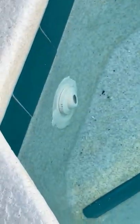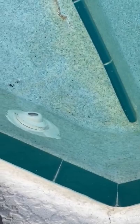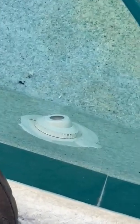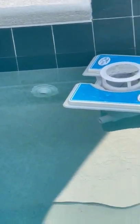Return lines are good as well. There are four jets here — the return line pipe is good, but around the jets it's all patched; it was already patched with epoxy around all four jets. Even with the patch, it is still leaking around the pipes, between the pipe and the diamond brite. All four jets are still leaking, even though there's already a lot of epoxy on each one.